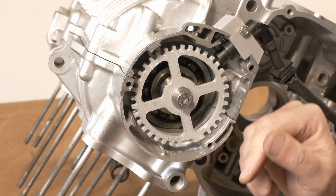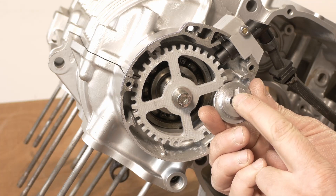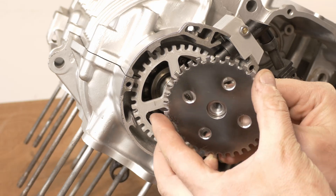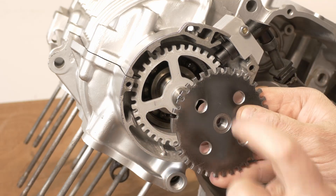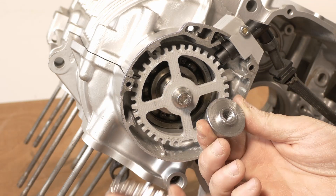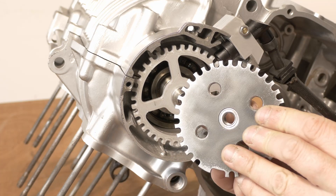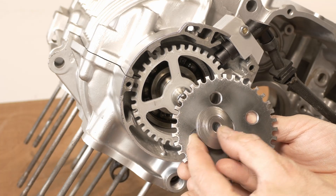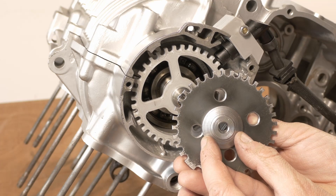I've taken all the burrs off and we also have the new hub. At the back you've got the keyway to locate off that pin, and it's quite a close fit - it can rotate on there and will be pinned when I know the precise final location. I've made this flange quite big so I can put a reasonably large pin through there. I might just tap a thread through both and use grub screws - maybe two opposite each other - which will then get covered by the washer, so that should prevent them from coming loose. Should be pretty safe.